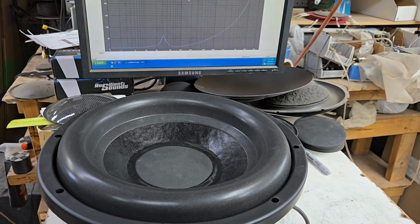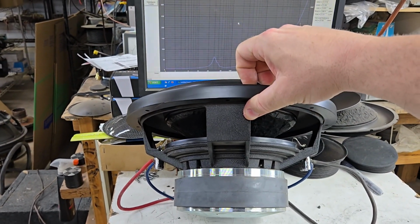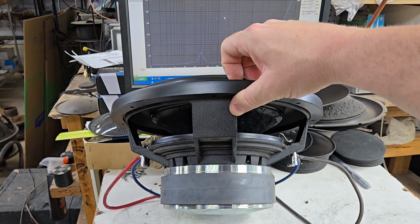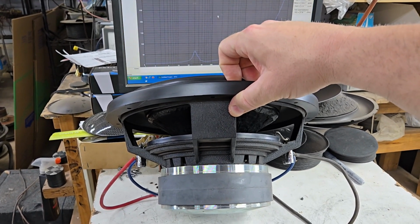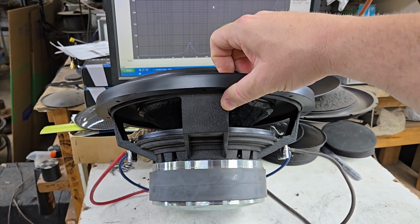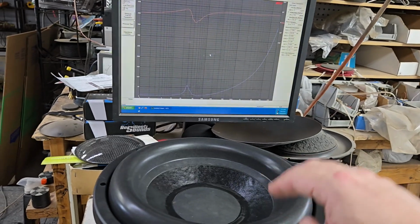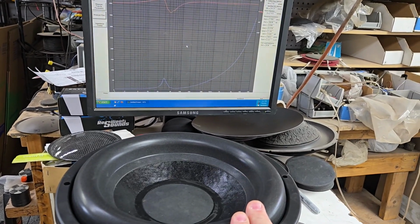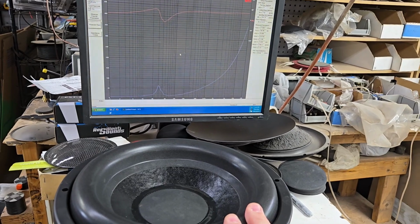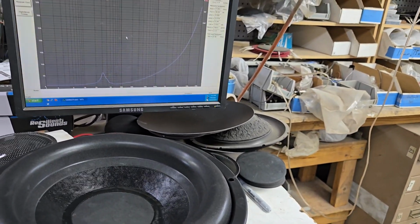Again, I think Oscar rated these at 1,000, which is pushing it. I would do closer to 850, which is what I recommend for the Rockford Punch HX2. So we'll do 850. So he can do up to a 1500 watt amp, and these are D4, so I would recommend the Recoil Audio RED 1200.1 as a good amplifier, because that does like 1500 watts at 1 ohm.